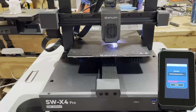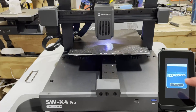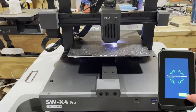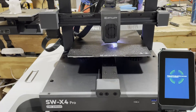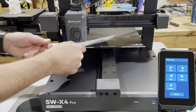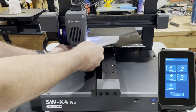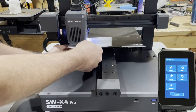There are six steps total — that got us through number one. Now it's going to heat to 210°C. You can see 211, 210 — everything looks good. Hit next step. Now it's time to do manual leveling. I'm looking underneath and there is nothing on my nozzle as it asked us to check. We need to wait for the platform and the nozzle to move. Starting with point one — when we put the paper underneath, we want a slight bit of friction.